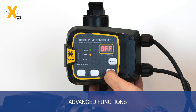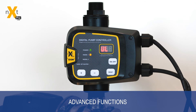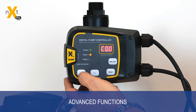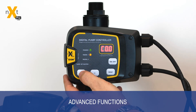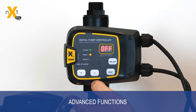To access the next advanced setting, go back into the menu by holding reset for three seconds and scroll down to UL, standing for underload. This is where you can set the detected run-dry of the motor without the flow sensor — so in times where the flow sensor may be jammed or not functioning correctly, the motor will still shut off, protecting the pump and system. This is done by reading the current of the motor. Look at the motor operating current, either on the plate of the motor or during operation through the display, and set this to approximately 90% of that current. Once set, hit the set key and you've got run-dry protection without the need of a sensor in the flow path.